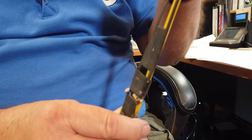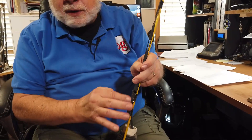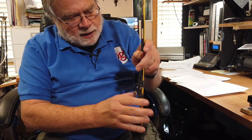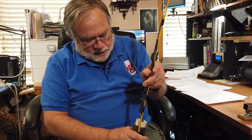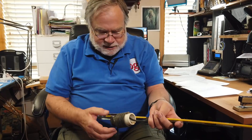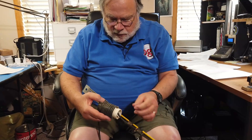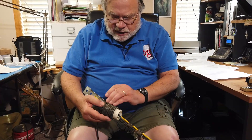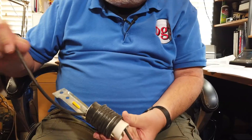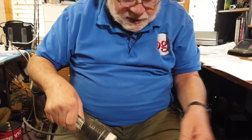The problem is that the J-Pol is a balanced antenna. These two are balanced, a kind of push-pull type of thing, and I'm using unbalanced coax. A lot of people just connect it right there and don't do anything about it, but the instructions on the net for making this antenna suggested strongly that I put several windings of coax together like this to create a choke balun that would convert the unbalanced to the balanced over here.